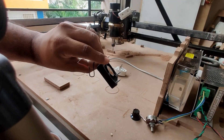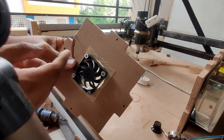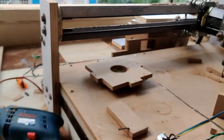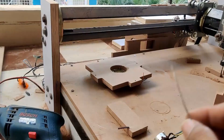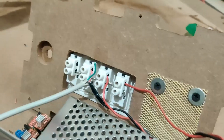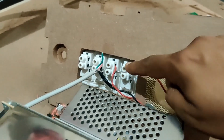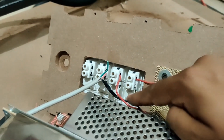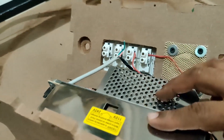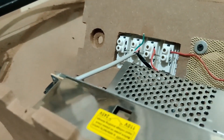This is the fan I am going to use — I got two of these for three bucks. It is a 12 volt fan and will directly connect to the 12 volt power supply. The next step is wiring. I stripped the core of one of the wires and connected all four positives for one side of the switches. One switch acts in series as the main switch — turn it off and all the others are dead. The other switches provide power to each individual module: spindle, spindle controller, SMPS controller for the motor, and the fourth is optional for a dust collection system.